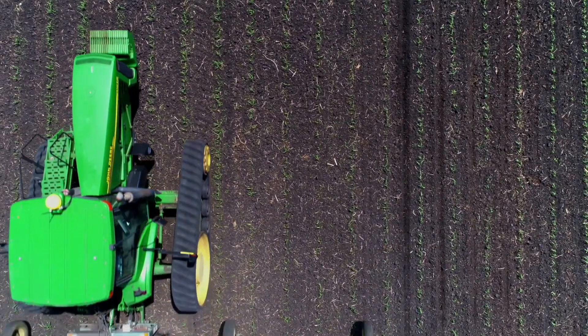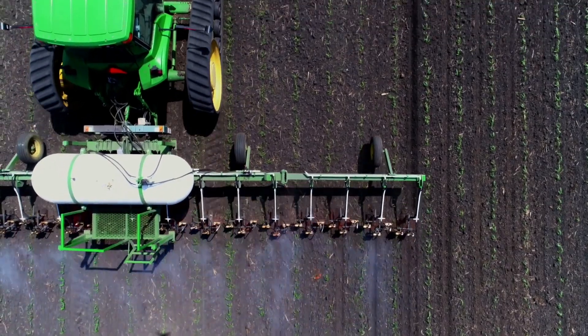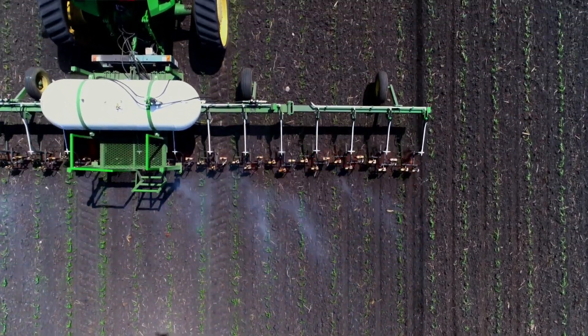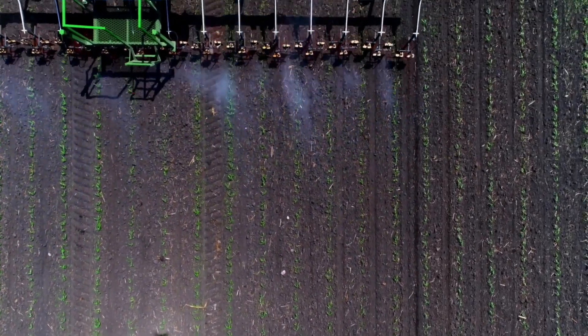While I did joke about these being exciting and kind of dangerous tools, I want to emphasize that they really are dangerous. With the weed zapper, bystanders must stand really far away because that electricity moves through the ground. With the flame weeder, you'll want to treat it like any open flame next to combustible material. If you're passing a building, a pile of straw, or working in a really dry scenario in your field, make sure you're not lighting more on fire than you think — you don't want a raging fire behind you after cleaning up your cornfield.